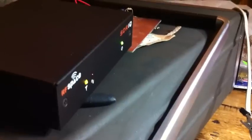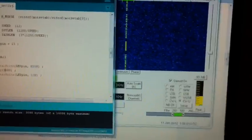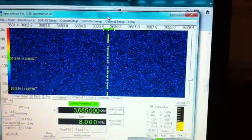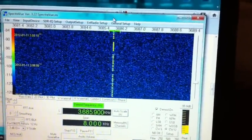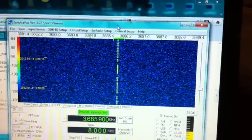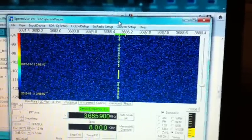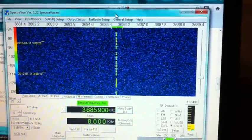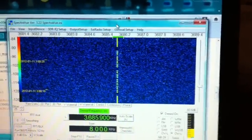On top here, I have this black box which is my RF Space SDR-IQ software-defined radio. There's no antenna hooked up here — I just have this wired to my PC. Over here, behind the source code for this app, you can see this, and if I turn on the audio — this is just the source code for a Morse code sending application that just toggles the pins on and off on the Arduino, and that actually serves to power this transmitter.